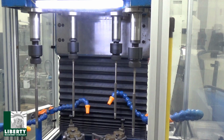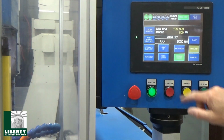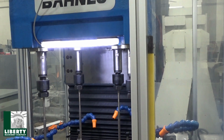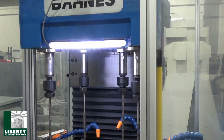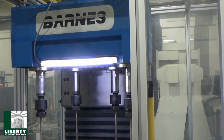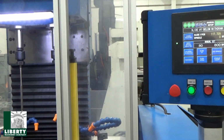I get up to 1,000 or 1,500 in the program, so that once they're inside the fixtures, I can go a little bit faster. Slide up, down, around 80. It's nice and easy, but just to see movement here. You hear the air pressure, it's hitting the counterbalance. Back up again, fixed at 80 millimeters per minute. And if I go anywhere above, I know my home position for the job is 210, so if I leave it anywhere above 210 up here, I can start my auto cycle.